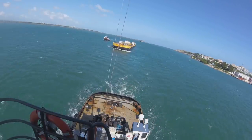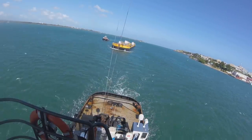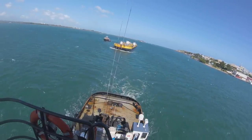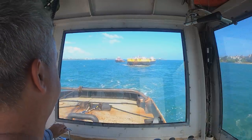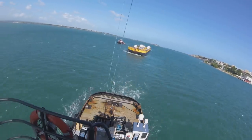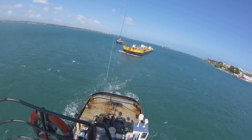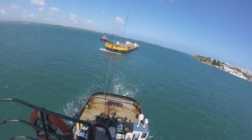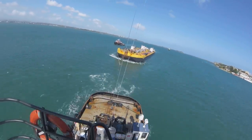You should start noticing that the barge is getting closer and closer to us as I keep taking in wire. I can wind this in quickly if I want to, but I know I've only got three minutes — if I wind it in quickly, the speed of the winch acts the same as me putting pressure on with the engines. So now I've got it down to two knots. By bringing the winch in really slowly, I can still reduce the speed of the barge by reducing the speed of the tug even more. We've sped things up just a little bit here, but you can see it's getting closer and closer.